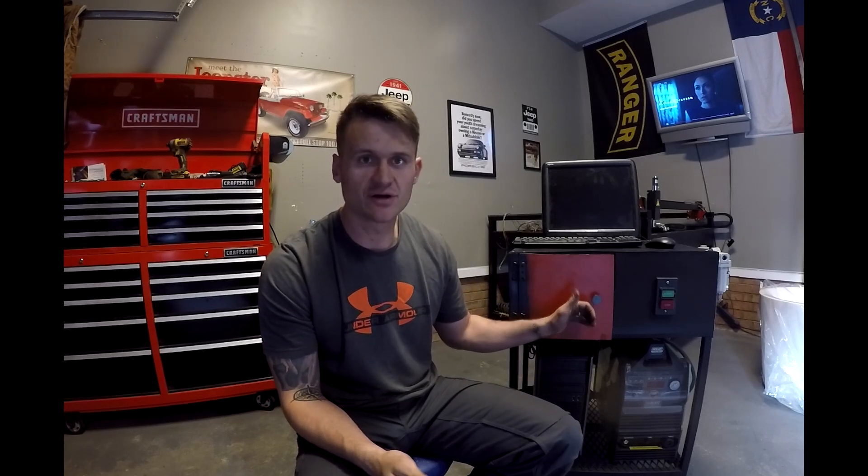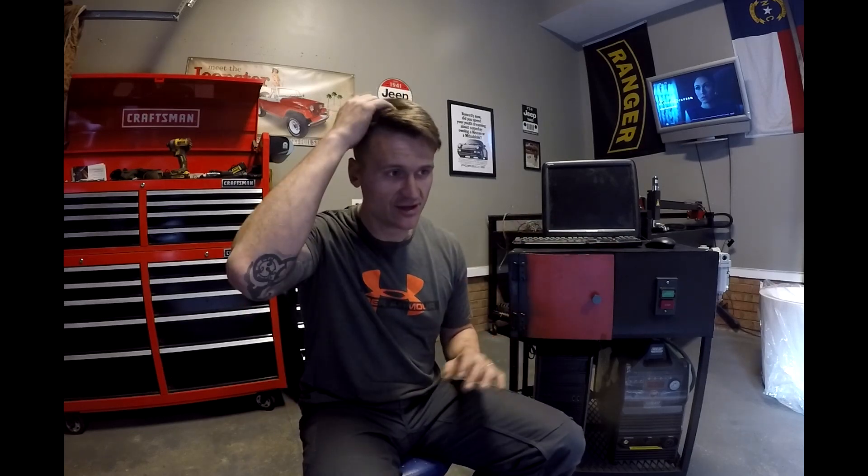We're at the finishing stages of wiring up the electrical stuff. The table is complete — all its wiring is done and ended with quick connect fittings. All I've got to do is roll them next to each other and plug them in. I'm waiting to do that until I flash this computer. It currently has Windows 10, and I'm going to use Linux CNC because it's free software and has all the features I need. I need to flash it with a Linux OS and then download Linux CNC. I've tested all the components on the control station side, and everything is working as it should. After that, I've got some fine tuning — tightening down the guides and setting up the system for test runs.